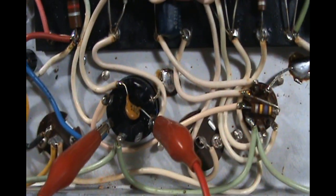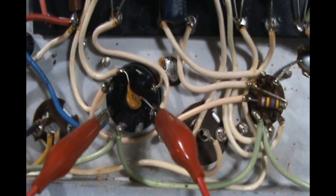As a matter of fact, the original tube in it, I think it's original RCA, the preamp tubes are RCA, was also getting pretty hot. Extremely hot at the base, which none of the amps I run with 6V6 tubes get this hot to where it discolors, like this. I didn't notice anything on the plate, like discoloration from where it may have been red plating, but we can tell it was definitely running super hot. And yeah, I would rather be within the spec limits, or close to them.